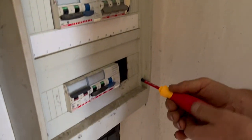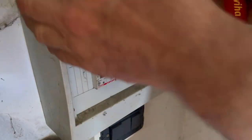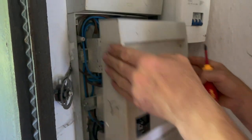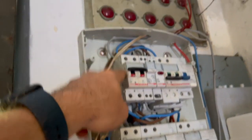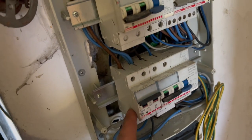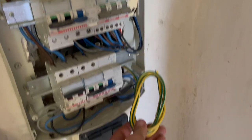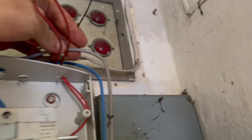This is a new meter that I installed — the three kilowatt one. This connects to that one, which in turn almost certainly only connects to this one and powers the basement. We've also found that there's no earthing connected, so there's a bit of a problem.